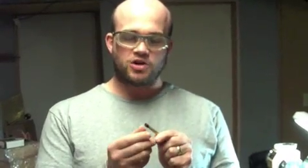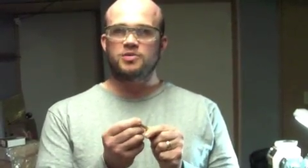Now that we have the shell casings drilled out, let's go ahead and put the brass tubes in. Like I said, the brass tubes are not going to fit in there snugly yet. What I do with that is I put on a little bit of electrician's shrink wrap. When you heat it up, it'll clamp itself right on there really tightly.